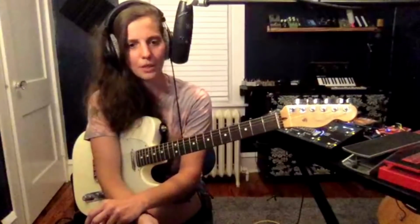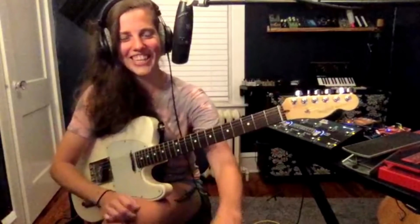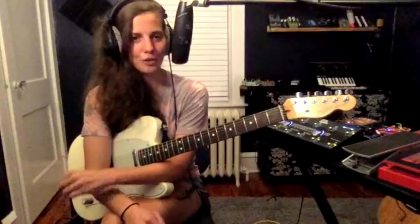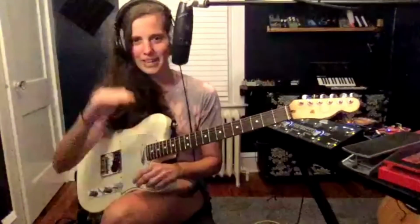I'd imagine with the tube amplifier, which has been around for a long time. If we have a tube amp, the tube itself in there is like a small amplifier. It's going to get a signal and make it bigger. But the thing with tubes is they have a point at which they max out, right? So if we push them really hard, they're going to get to that point where they're maxed out, and then they're going to do the best that they can. But the result is going to be this kind of smushed, distorted sound.